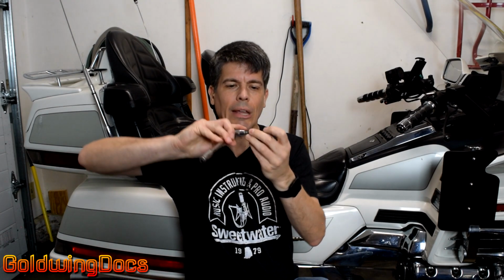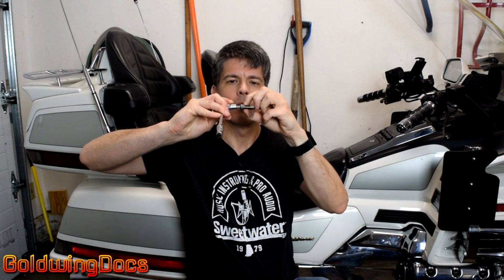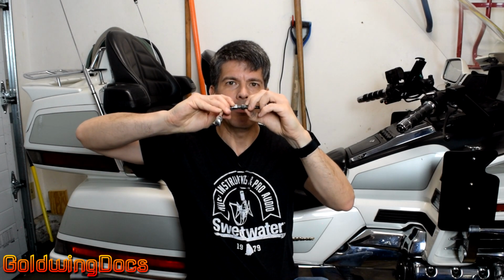The secret is steel. Steel stretches. Now if I had a fastener made out of, say, ceramic that doesn't stretch at all, I could screw that in, and as soon as that head touched the surface of where you were screwing it into, you would not be able to turn it any farther. And if you did, it would just crack and break.